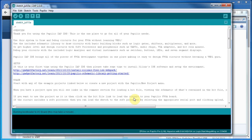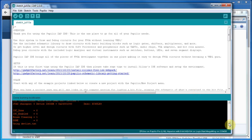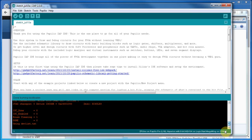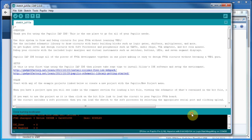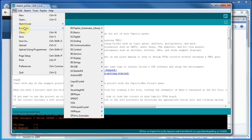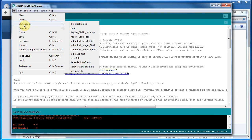So the whole system's very slick because it just has an attached flash chip, and it uses that for storing the FPGA code, so we confirm that all worked. Yep, verified. It also stores the source code for our soft-core processor. So it's really like a regular system. It just comes up and it's live. You don't have to deal with any stuff yourself.